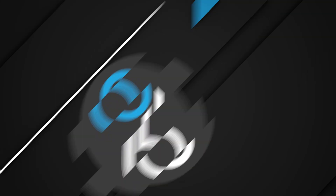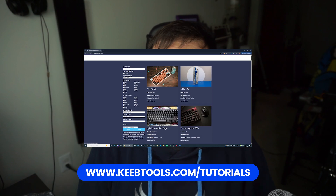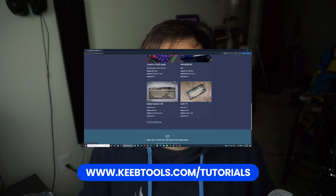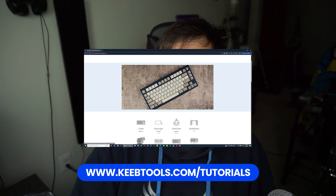There you have it — it really is that easy to test your keyboard hot swap PCB before assembly. If you run into any keys not firing, make sure in VIA that it's programmed and bound to something that should be firing, then visually inspect the socket. If you still have issues, contact your vendor. Don't try to fix anything with a soldering iron before contacting your vendor, because that will void your warranty and defeats the purpose of testing in the first place. This video is going to live on keebtools.com tutorials — keebtools is a website where you can browse community keyboard builds and reviews of keyboard vendors, and post your own builds and reviews. I'm Ali, I'll see you in the next video — be good to each other.